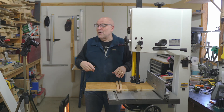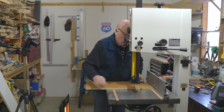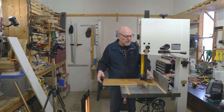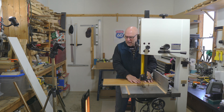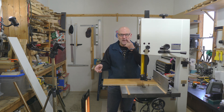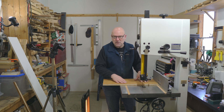I've looked around through all of my materials and found a couple of oak runners that will fit in the miter slots on both sides of my bandsaw. I'm going to use an off-cut piece of the shelf I used for making the platform and cabinet for the winder. I've brought the fence right up to the runner, which leaves about 16.5 inches out on the other side of the blade — so I could do a 32-inch circle on this jig. I'm not going to make this a throwaway jig; I want to be able to use it for other circles. I don't think I'd ever cut circles much bigger than 12 inches, and this will handle that easily.